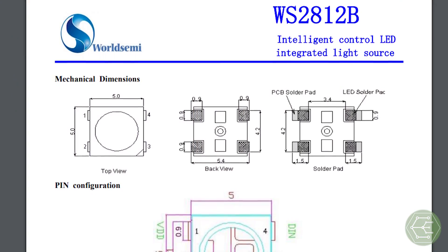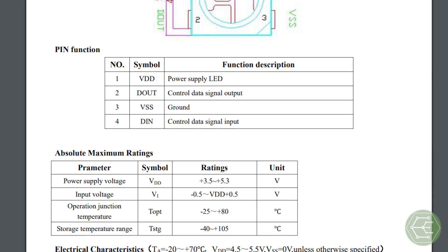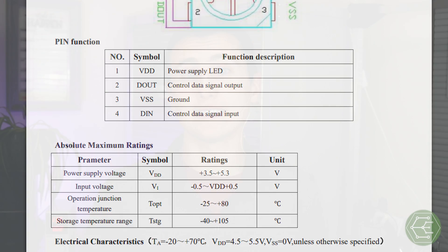That circuit in the future will use WS2812 LEDs and those need 5 volts. Our lithium batteries will vary from about 3 volts to about 4.2. Both of those are less than 5, and while 4.2 might be close enough that it might actually work, that's really not a good design. Of course we can always just adapt the 5-volt input and run that circuit off of a 5-volt input, but if I want to put it on a shelf somewhere where an outlet isn't convenient or accessible, it might be nice to have the option of unplugging that sign and running it from a rechargeable battery.